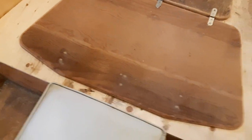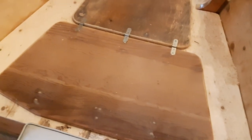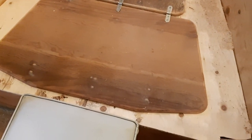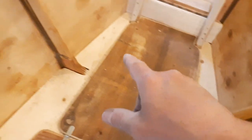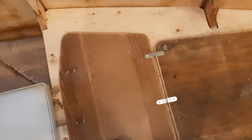This is the storage unit with three chambers — all this decking has to come out yet but the framing is done to support everything. This is actually a really nice piece of plywood, not a knot on it. Ideally I'd like five-eighths and three-quarters thickness so weather stripping can work, making it about 90% watertight but not 100%, because all three chambers drain. In the front there will be three flotation chambers filled with blocks of foam to dissipate the air space, and it's all epoxied.